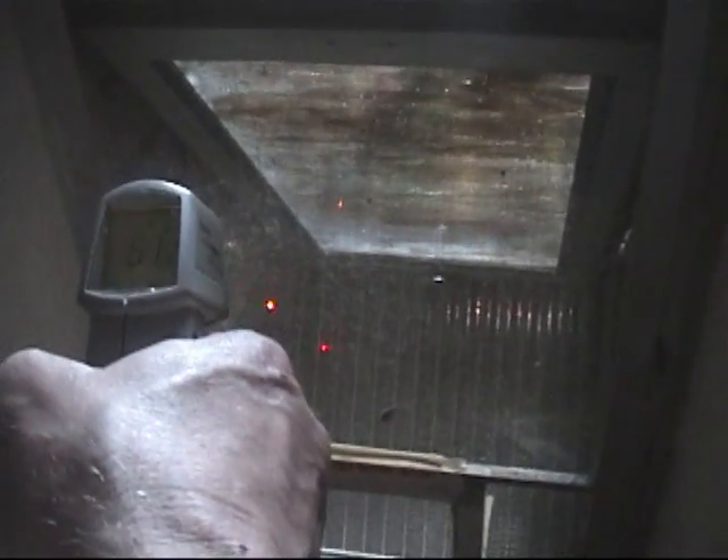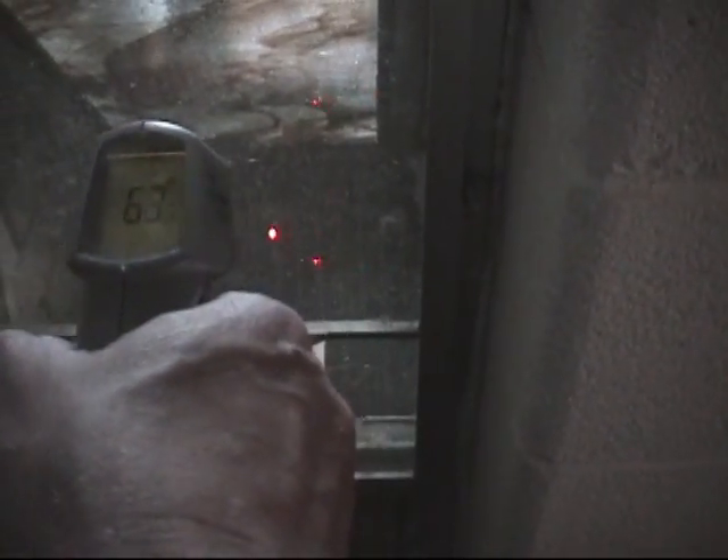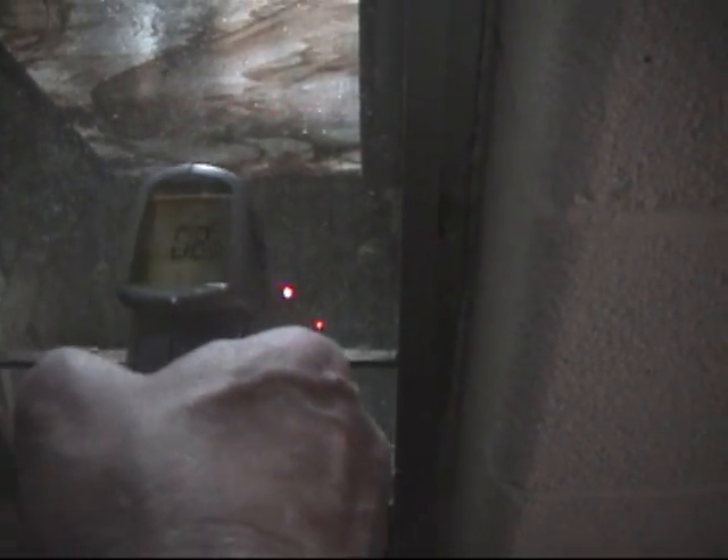As you can see, it's coming down — we're at 61 in this corner now. The front coil is the second largest. It's a 15-inch, but it's longer than the other. Readings are 63, 62, 63, 64 — it varies a little, but at least we're in the low 60s on the coil temperature, and that'll start bringing the air temperature down.